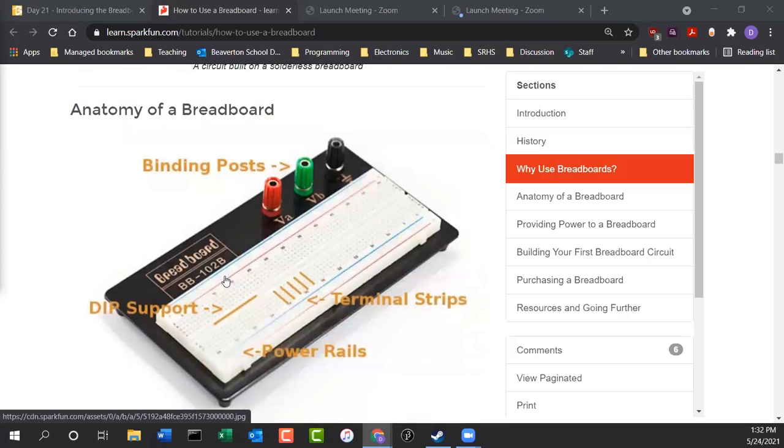So here's a fancy breadboard. This is one that you would use if you were in industry, like say electronic engineering, you're coming out with a prototype. What I like about these types of breadboards is they have these power posts where you can plug in your power supply. You can dial in with one of these fancy power supplies, and I'll bring one into class so that we can look at them. But you can set the amount of voltage you want, the amount of current that you want in this power supply. Say you lost a little wall wart for a gizmo, you don't know where the cord is. Well, if you have this power supply, a DC power supply, you can use that to power your piece of equipment that you lost the transformer for. These are really quite cool. I have tons of them, and we'll learn how to use them, perhaps either in this class or in an upcoming class.